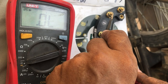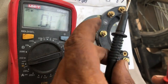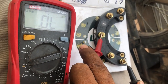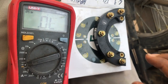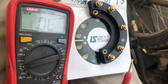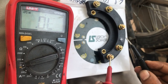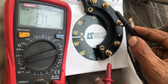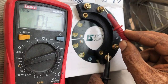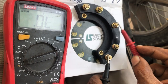Here you can see the readings are 0.470, 0.495, and the first one was 0.505 or 0.506. If we reverse the polarity it won't show any reading, which means that the bridge is okay. Now, for the positive side of the diode bridge, we will make the negative probe as common and then test all three diodes.